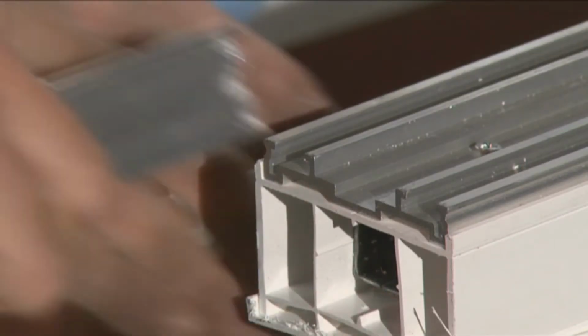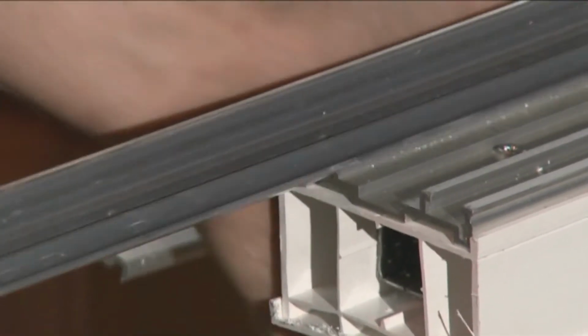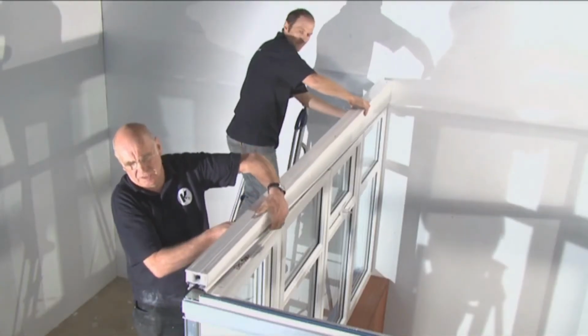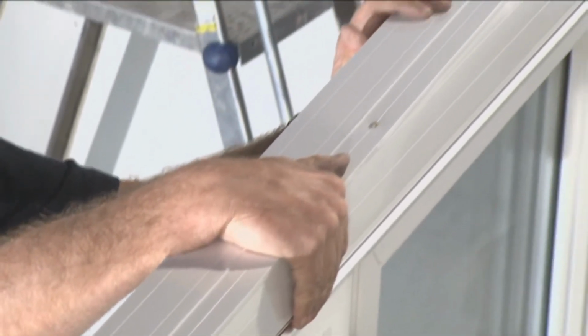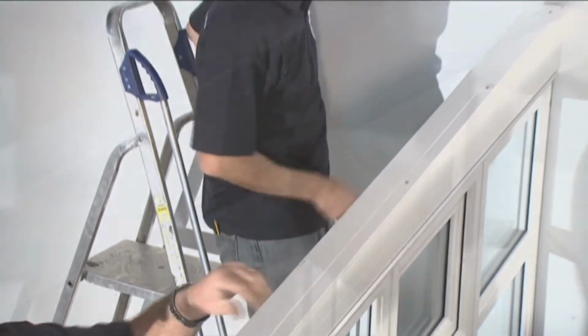Slide the two-part connectors onto the furring connectors, ensuring that the location legs interlock. Repeat for second furring. Position the furring assembly over the side panels. Ensure the location legs interlock with the windows and butt up against the eaves beam and wall.